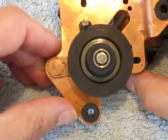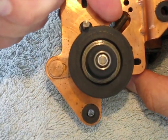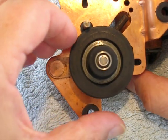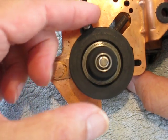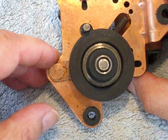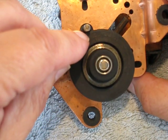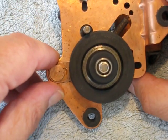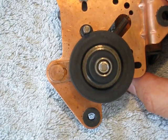The problem with these — you'll notice that these are spring loaded. There's a spring along the side here that keeps pressure or tension with the idler to keep the pressure against the drive shaft on the motor. And after a period of time, especially on these older machines, you're going to open it up and find that there's a divot that was left because it's rubber and it develops a divot there. And every time you turn the thing on, it goes thump, thump, thump. Not very pleasant while you're trying to listen to your player.